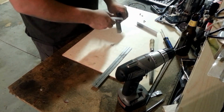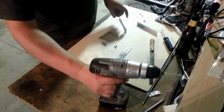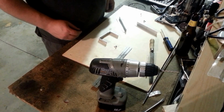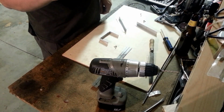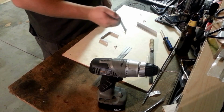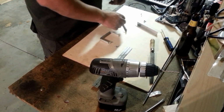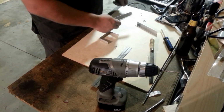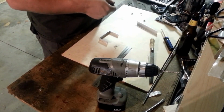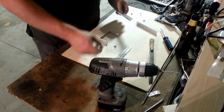So what I'm going to do instead is use a drill bit to drill a hole in the aluminum. I'm actually going to use some of these coarse thread computer screws. I've done it several times before, and it works pretty well. They're like the ones you'd mount a hard drive or a motherboard with. They're harder than the aluminum, as long as you don't have aluminum screws. And as long as you get the hole close, you can just screw it in and it's almost self-tapping. Again, it's not holding any heavy loads, it's just a phone. It'll be fine for our purposes.